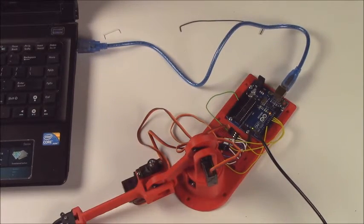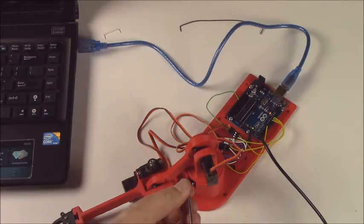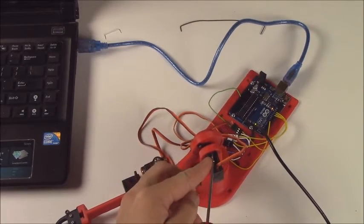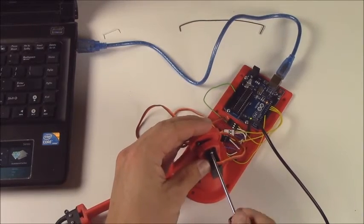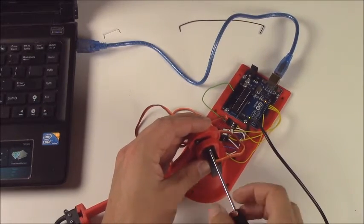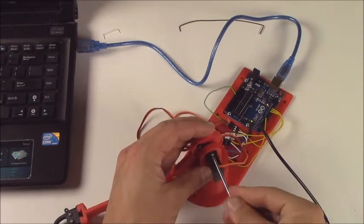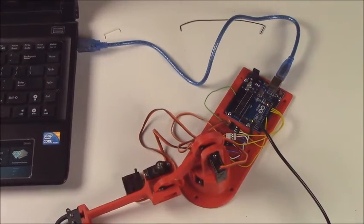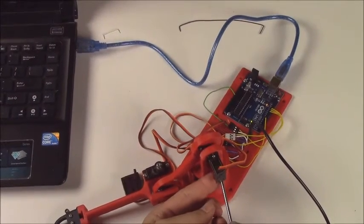Right now the servo is positioned at its lowest position. Line up the upper arm so that it is at its lowest position, and then we know that everything's kind of synchronized. That's as complicated as the calibrating gets. So you move the servo to an extreme, and then when you mount the arm, you make sure that piece of the arm is located at that extreme. So in this case, the servo is all the way down, so the upper arm is mounted all the way down.